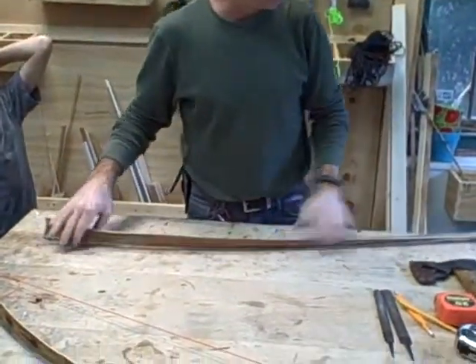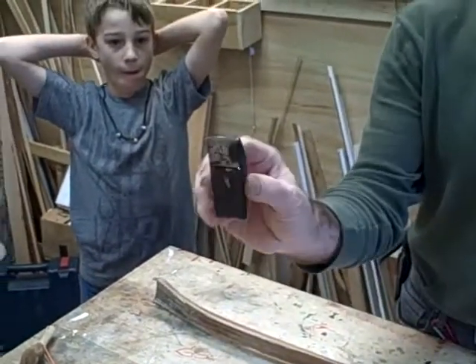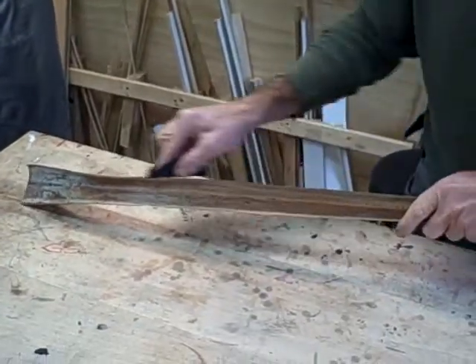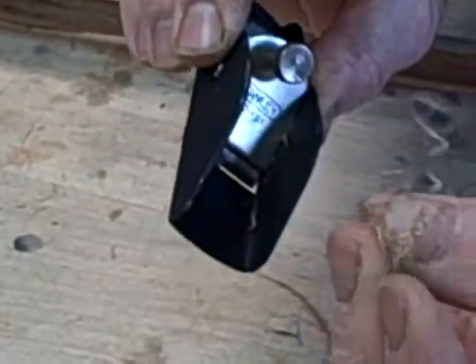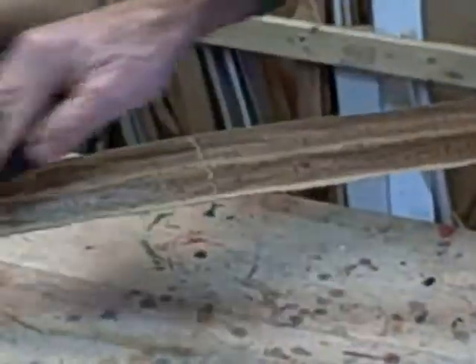So first thing we're going to do, Michael's going to take this little hand plane — you can buy these at a hardware store, they're really inexpensive. It's not a chopping tool; you just want to take fine pieces off with it. I'll show you what it looks like when you do it properly — that's all you want off of there. If you've got the blade adjusted too far out and it cuts like a knife, it's not good for the tool and it's not working effectively.